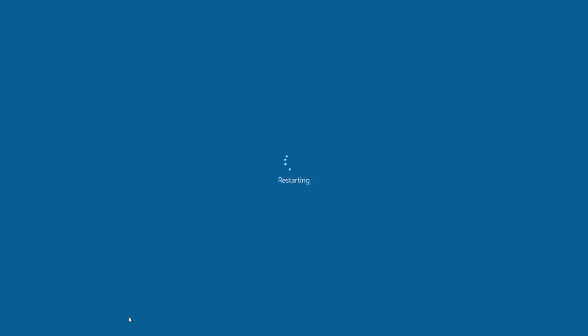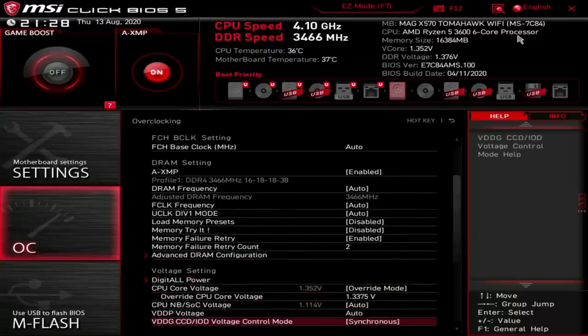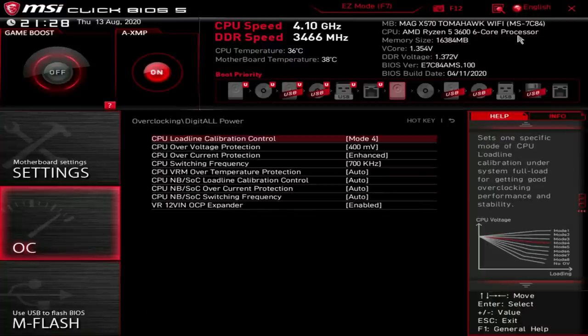So I'm just going to set the LLC all the way down to mode 8 or whatever, because there was like no droop on that, which is not good for your transient response. I could lower the voltage, but the thing is... Well, actually, I have a video covering that, so hopefully I'll remember to include the video on why you don't want to just have zero V-droop somewhere in the description. So we're just going to max that all the way out.